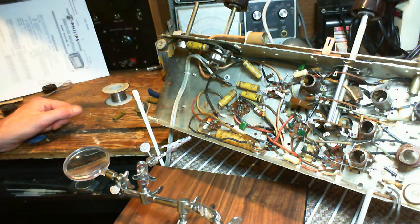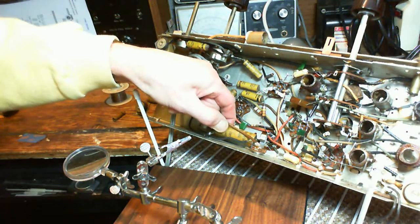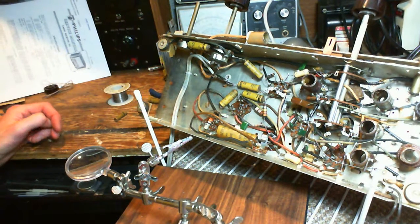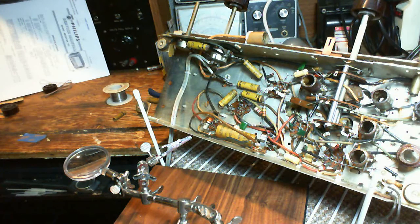The next big one is a 0.082. Where do they come off with that kind of value — 0.082? What am I going to do with that? Well, what's it doing? It's grounding the radio chassis. How critical can that be? Why can't I just put a 0.1 there? Why a 0.082? Why is it so bloody big too? Considering the value of these capacitors are all off — very few of them would still be at their rated capacitance; they drop down in capacity.